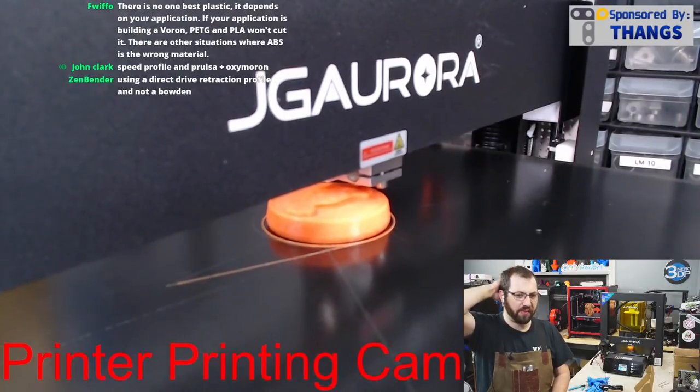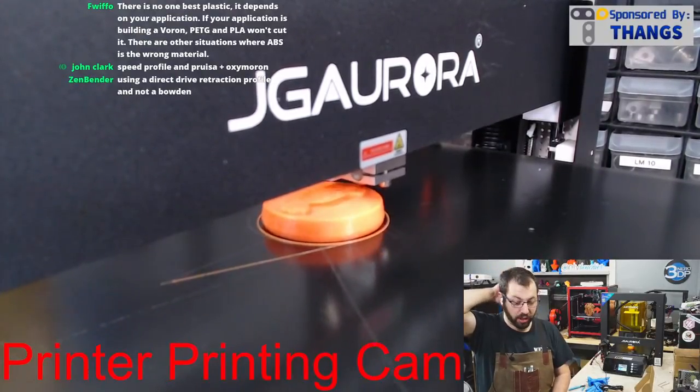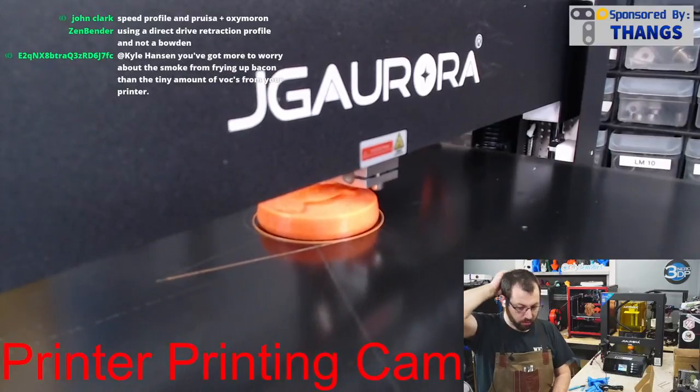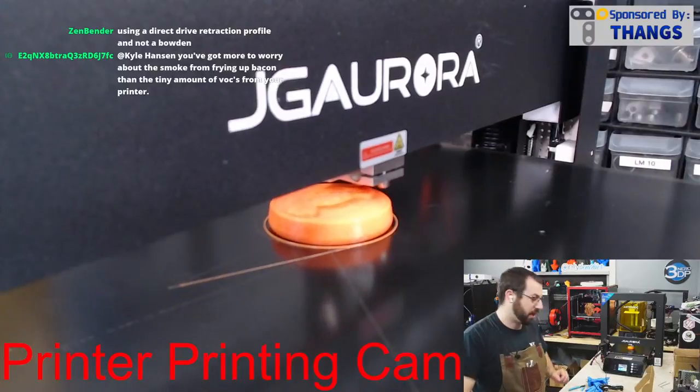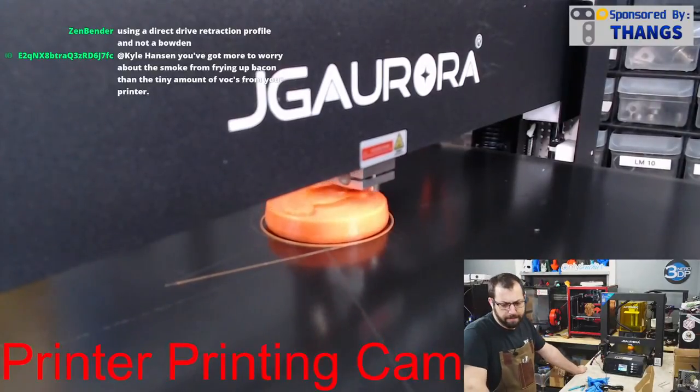CF nylon. The problem with CF nylon is a lot of them have creep issues, apparently. Nylons have creep issues. So mine, I think, is okay, but we'll find out. If not, I got a spool of CF PC I'm going to try.